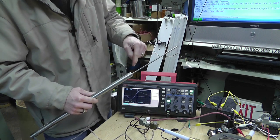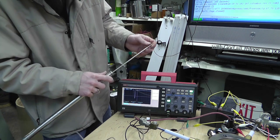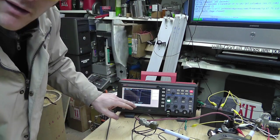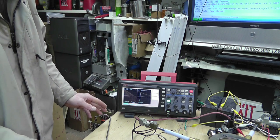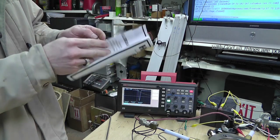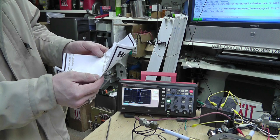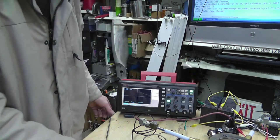Now you may be asking, well, how can I record this? Well, I can record on this oscilloscope, so every time I fire it, I have to record it, and I'll see that right there. Okay, that little peak. And then I can go in here and I can measure that, and that will tell me exactly how far this piston moved. This one is calibrated to be 1.6460 volts per inch. Okay, that's pretty darn accurate.